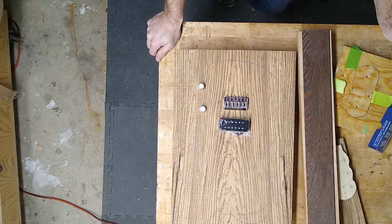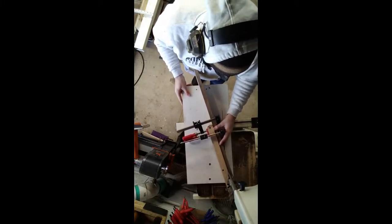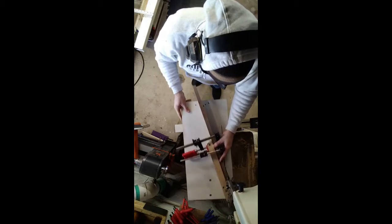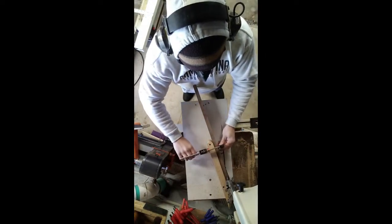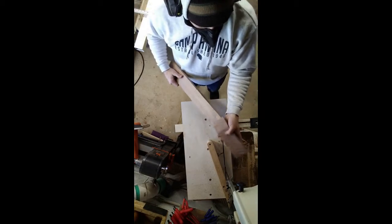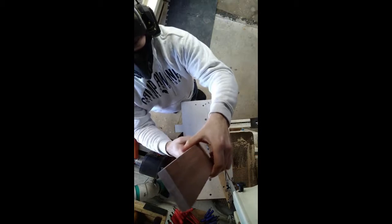So we went from that to cutting our scarf joint, and if you're looking at the scarf joint, this is one of those areas I said I need to retool and get a better alignment setup. What I have works. It's pretty basic, but again, this is an area where I have to look for more precision and a little less stress in the glue up and the fixing of that joint. So that's one area we're spending more time reviewing, but you can come up with a headstock that is the wrong angle, not steep enough of an angle, the wrong thickness, or you can even have a skew in your headstock as you make that joint.